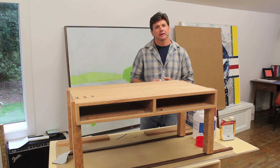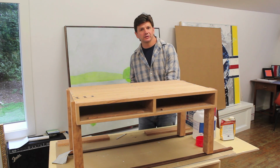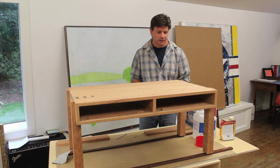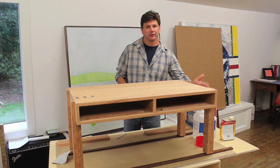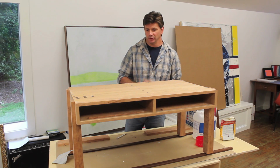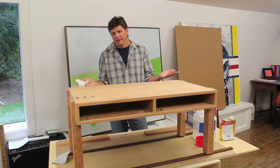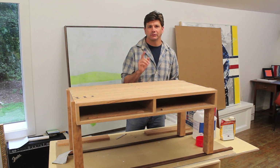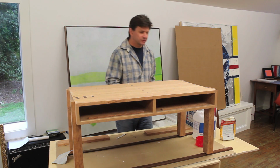And once that's done, basically you just continue to repeat the process for however many coats of finish that you want. Now I'll probably do 4 coats on the legs and the body, and maybe 6 to 7 coats on the top of the coffee table. Now, I'm not going to video that because it's basically the same thing over and over, but I will show you what I'm doing in the next video, which is kind of cool.